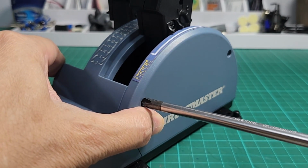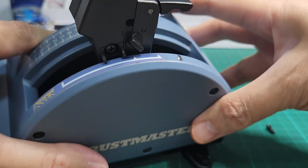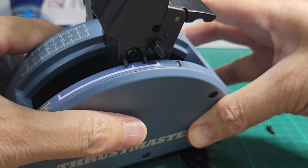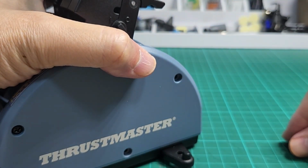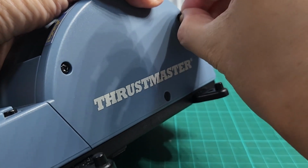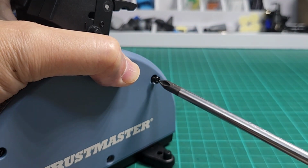Nice and easy. Now, as a tip, while you're holding the panel in place with your hand, try to slide the lever and find any of the new detents. Once the ballpoint is sitting on one of the detents, this makes it easier for you to press the panel in place, because they are much closer to the case when the ballpoint is inside one of the detent holes.